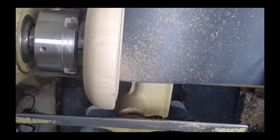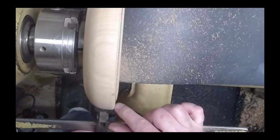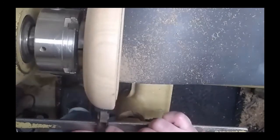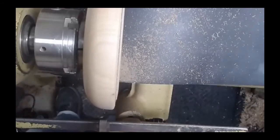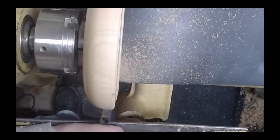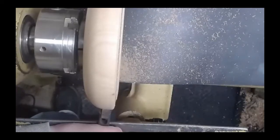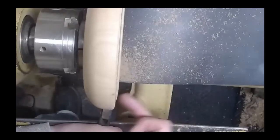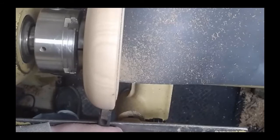One of the things you want to make sure with any of these tools that rotate — you want to make sure you've got enough room between your tool rest and your piece for the wheel to rotate freely, so it doesn't bump into your tool rest. What I'm going to do is go straight in, put the tool on the work so that it rides, let it go, count to about five in my head so that it goes deep enough, and then do pretty much the same thing I did on the face — separate the texture from the outside and from the rest of the piece.